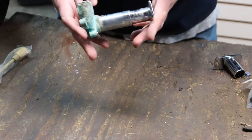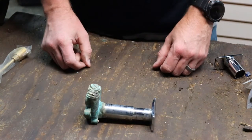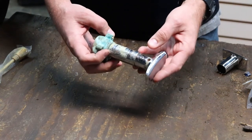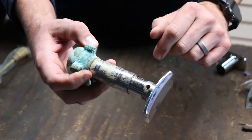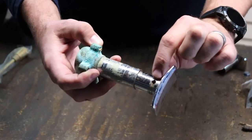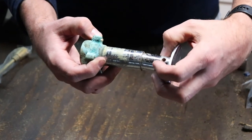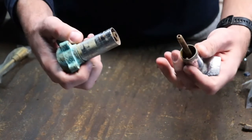We're back here in the shop, and this is the American Standard part. Typically right here there is a set screw. You remove that set screw entirely to pull this handle off — it's not like any typical set screw. There's a pin that goes through the stem. With most faucets you just loosen the set screw and pull the handle off, but you can tug and tug and this won't come off. However, this one is broken, so it's just going to come off in our hands because the stem did break.